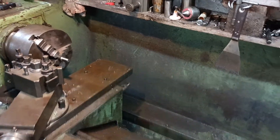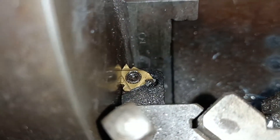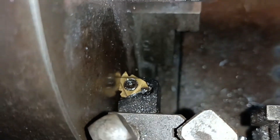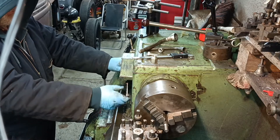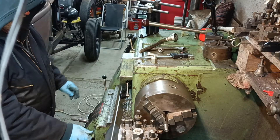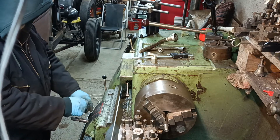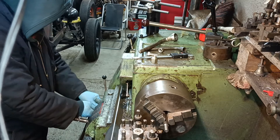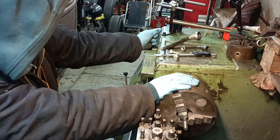I'd say that is parallel — that's flat against it. Double check it hasn't moved, which it doesn't appear to have. I've put the lathe on the slowest speed. I've moved the lathe over to screw cutting. Double check that's in the 20, double check these are in the right position, double check that's on English, and move this lever this way like that.